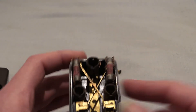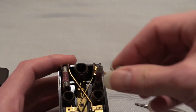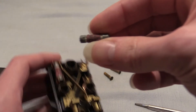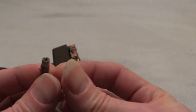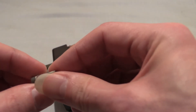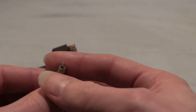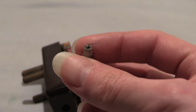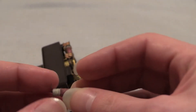Let's dig these little fuses out — they're not standard fuses. Oh, it's all falling to pieces. By the looks of things, that's actually not a proper fuse in there — it looks like someone's modified it. You can see the piece of wire coming out and there doesn't appear to be any sand in there. So someone has modified that one — that's a bit naughty.